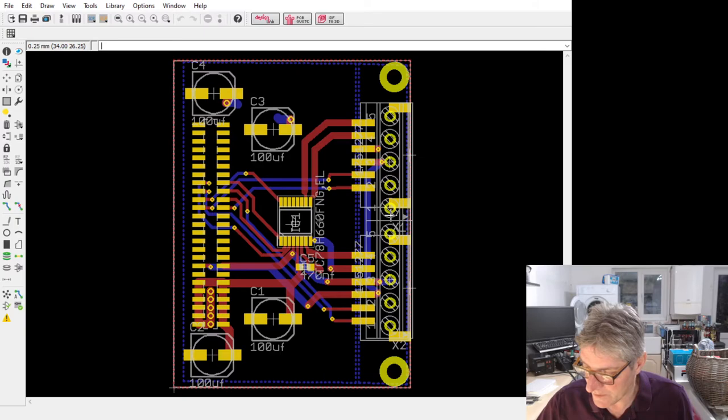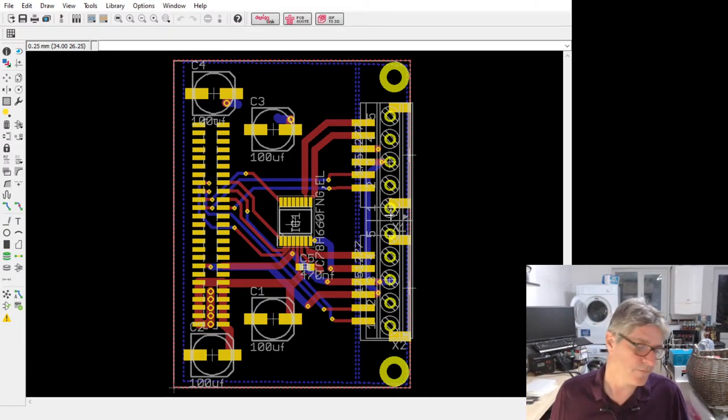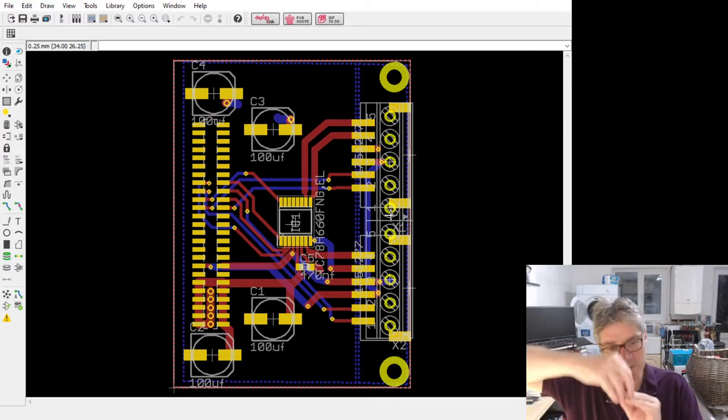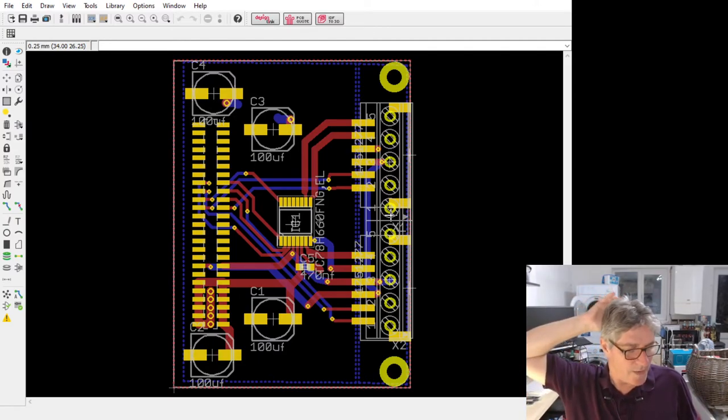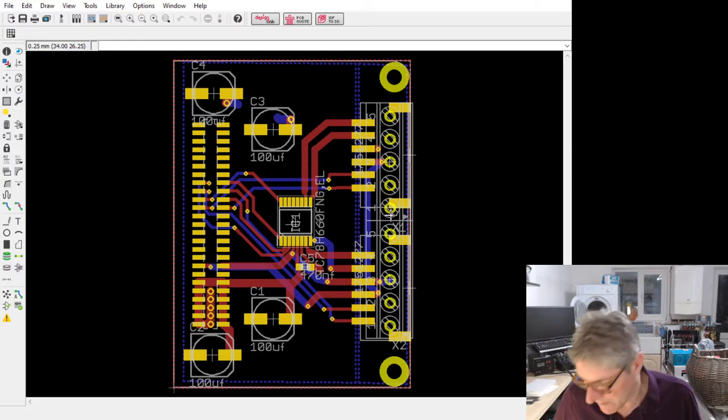the fixing or the connection isn't always as good because it can bear down on one and not the other. You have to be a bit careful when you do the screw up to make sure that it's grasped both of the conductors. So not only is the conduction, but the wires don't slip out, because otherwise it can rest on top of one, but not the other. The other thing you can do, of course, is solder them together. However, then you might have issues with cracking, but this sort of application is probably okay. It's hardly military, but it does need to be robust.